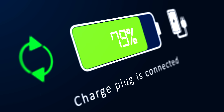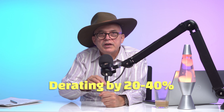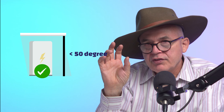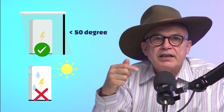You may have also heard about the derating factor when it comes to batteries. After a number of years of recharging, the battery will have gone through many cycles and might have deteriorated by 20, 30, or even 40%. When the remaining charge capacity has been reduced to around 60% of the original capacity, experts advise it's time to replace the battery. Home storage batteries kept in temperatures below 50 degrees will last a bit longer, so the derating factor will be less. But if you have them in very hot climates on a western or northern wall, it's really not recommended — they should be in a garage. In those cases, the derating factor will progress faster.